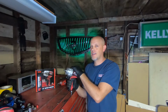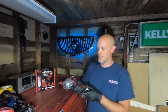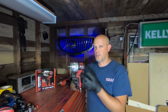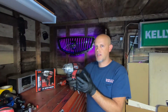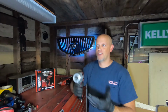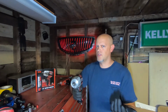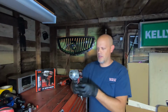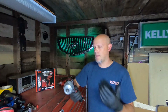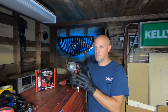Before I get into everything I like about it, I gotta give you some negative things. A couple things that don't bother me but might bother someone else. The first thing I can think of is the settings. The trigger settings, you have one reverse, which most guns only have one reverse. You only have two settings for the forward. You have the low setting and then the high setting, which I never turn my gun down to low. I just normally use the variable trigger, and that's normally what I use. If any of you guys are turning the triggers down or the settings down, leave me a comment below, because I'm pretty sure no mechanics are actually doing that. But I guess if you needed to, just turn it down to the low setting. It'd probably be good enough. So that might bother some people, doesn't bother me.